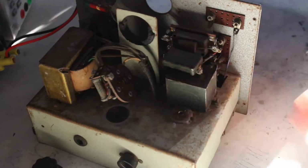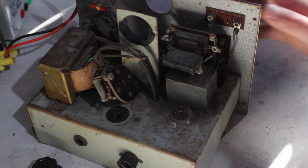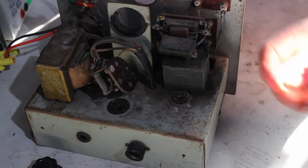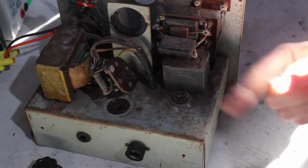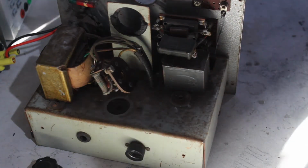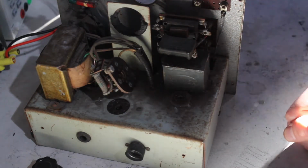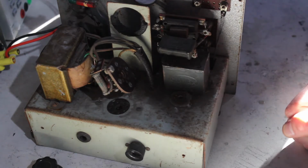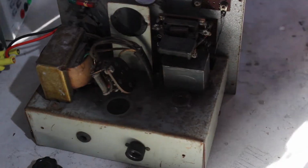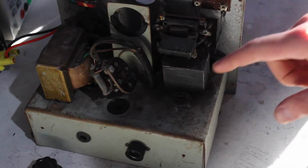There's a capacitance standards here on the top shelf. A number of silver mica types there, and one of these big metal oil filled things which usually contain PCBs, polychlorinated biphenyls, I'm not sure if that's pronounced properly, which cause cancer and all that sort of stuff, which again, it's no problem if it's not leaking, but I think this does look like it might be leaking.